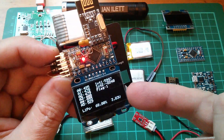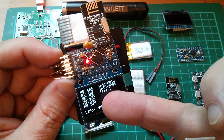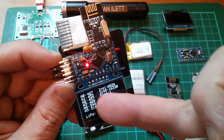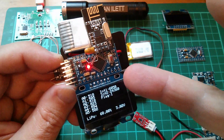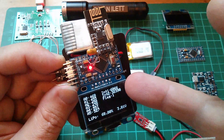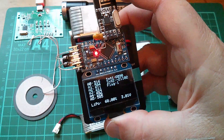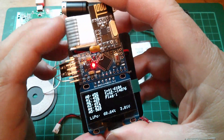I've put quite a lot more information on the display. The transmitter now reads all of its analog inputs A0 to A7. I'm only displaying six of them here, but it's sending all the data out in one packet. A packet can contain up to 32 bytes, which is probably 16 integers - I'm transmitting 11 values: the eight analogs and three integers. One is a simple counter, one is millis from the transmitter, and a flag indicating whether the transmission passed or failed. If I put my finger on the analog pins you'll see all the analog data change - that's genuine analog input information being sent over.